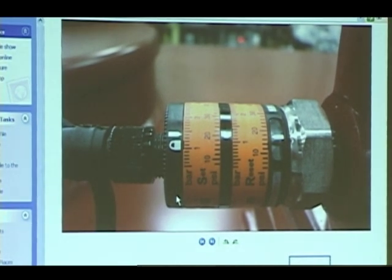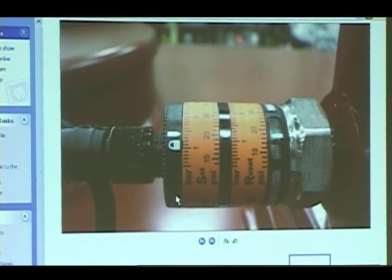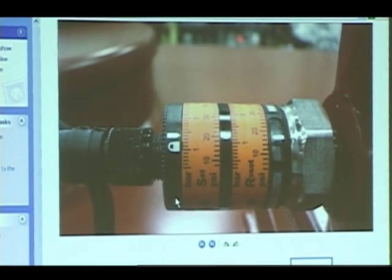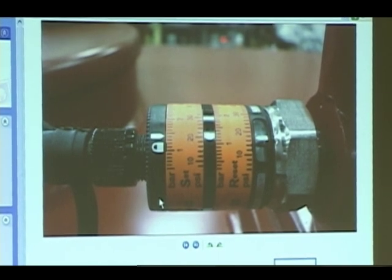So, is it automatically reset? Yeah. To get more specific, there's a time delay in there, so it can see 2,000 for a period of time, but then it's got to drop below that lower value for at least 3 seconds to ignore that first spike. So it gives you a little bit of a window. But once it trips, obviously, then it's tripped and you're done. You're going to have to find out what caused it.